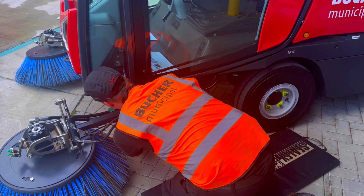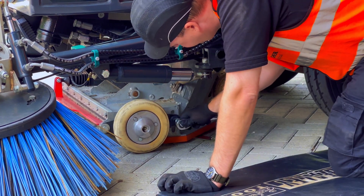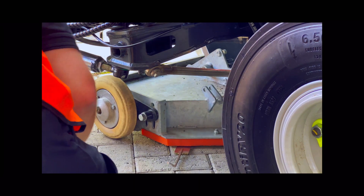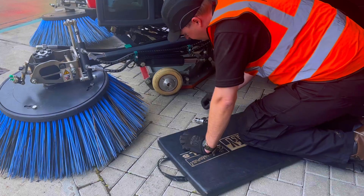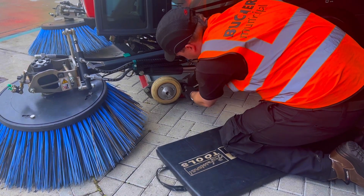We're going to loosen off at the pivot, and as you can see, now the box is dropping onto the anvil in the correct position. We're happy with that — you've got your 5mm — and then all we need to do now is tighten it back up.